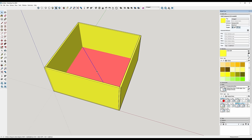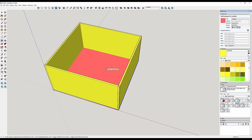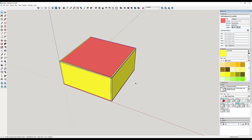Let's click this diagonal, and yeah, I might need that again, but I'm going to delete it anyway. Click the bottom panel, M for move, Control brings up copy, select this top face, press up to constrain to the blue axis, and drop that copy off right on the top. So all of these pieces are conflicting as far as sharing that same physical space, but that's okay. I'm using CNC box joints for all of this, and that's just fine.